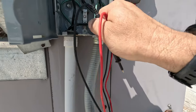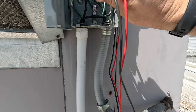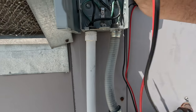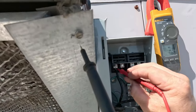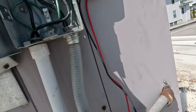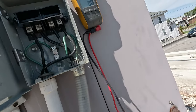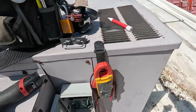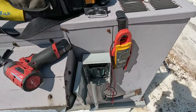We've lost power on one of the legs. There's 108 volts. Going to ground: 209 on one leg, 41 on the other. So we're getting stray voltage going through the windings on one. We've got a problem down at the breaker — they've tripped it so many times that they've probably blown the breaker.